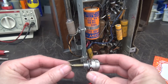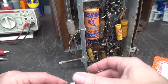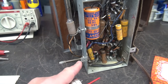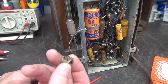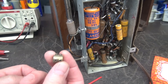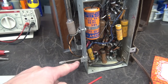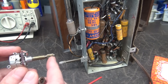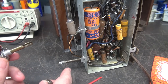So what do you do when you need to replace the pot and you want that original shaft so you can put the knob on and make this thing look original? Well let me show you a solution. I'm going to use this pot as the replacement, and to get this shaft the proper dimension, I'm going to use one of these quarter-inch couplers. You can find these in old radios too. This allows two quarter-inch shafts to be joined, and they've got set screws that hold them. You'll find these a lot in ham transmitters. So what I'm going to do is cut the shaft off of this pot and cut this shaft off, and make sure the dimension between the two shafts equals two inches, so this coupler will be in the middle somewhere. The first step is to get a Dremel tool and chop that guy off.